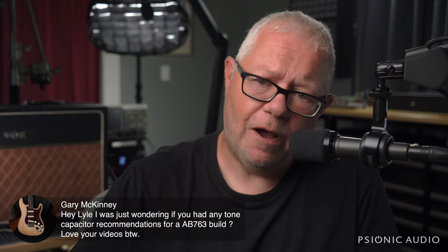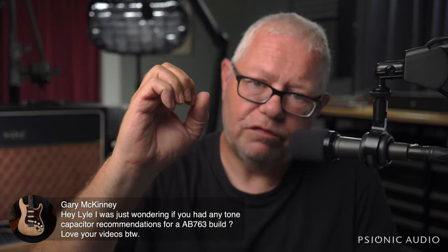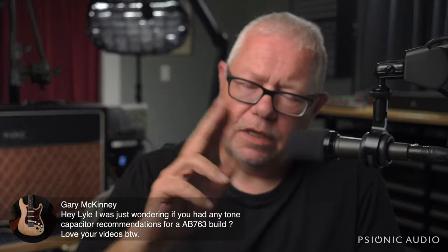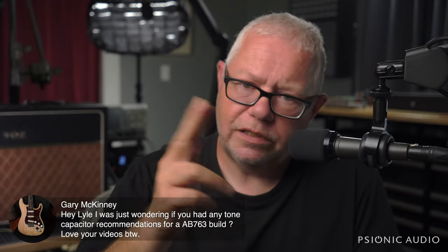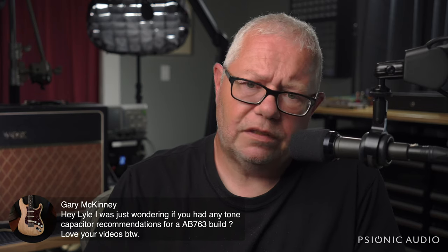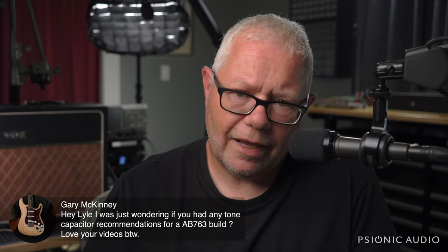Well, now you've got this honking big mass of orange stuff supported by little spindly wires, and every time that board flexes, it vibrates, puts stress on things. It's really not the right cap for that. So I look at what axial caps are available.